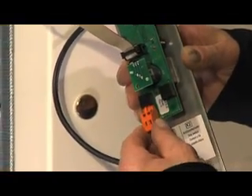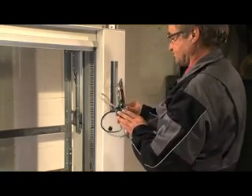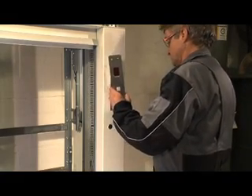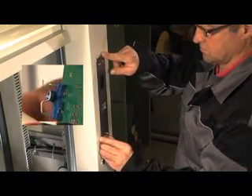The bus cable is to be connected as well as the magnet sensor to X01. Please ensure that only on the bus cable ending, the blue bridge on the printed circuit board is closed. It needs to be opened on all other push-button stations, otherwise malfunctions can occur.